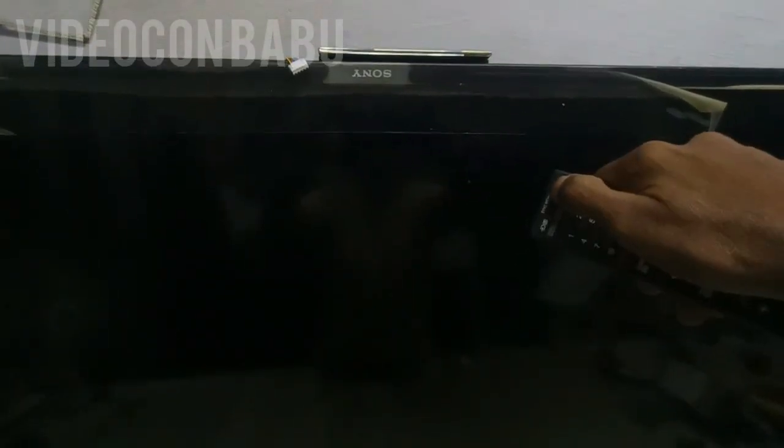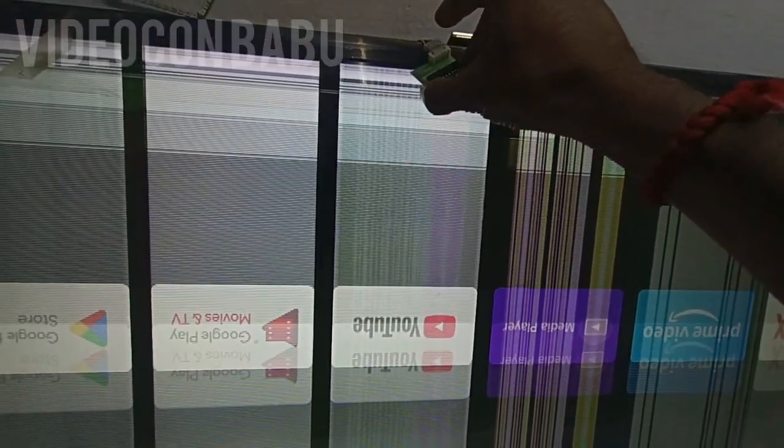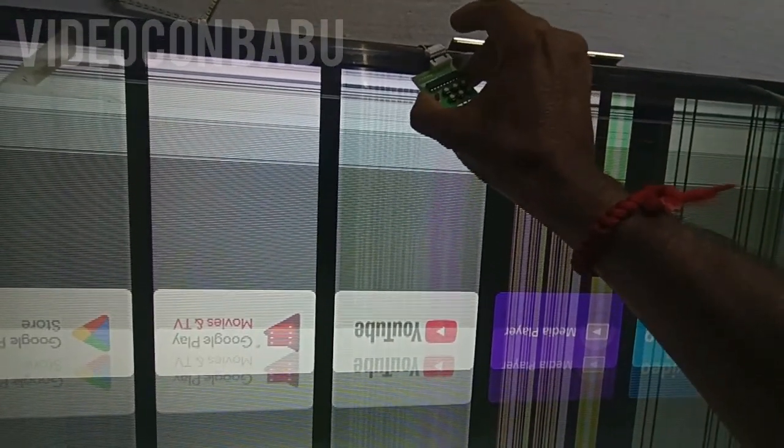Module removed. Releasing standby — see the picture with vertical bar. So this panel has a right and left side short. The right side Y signals are totally blocked. On the left side there is a fault, some of the tracks are blocked.